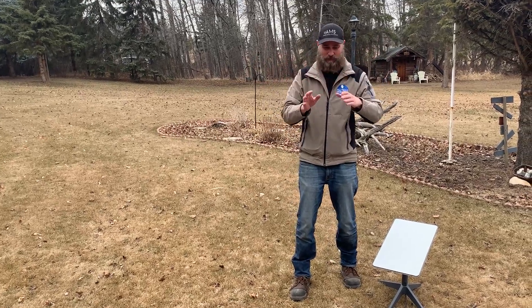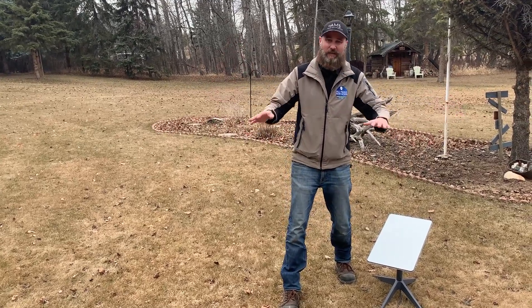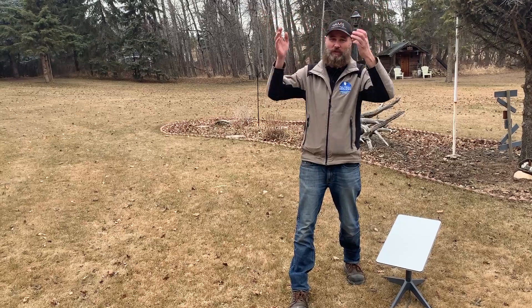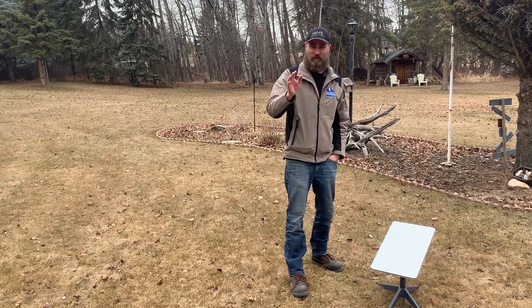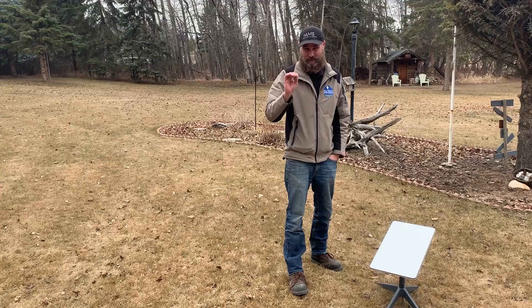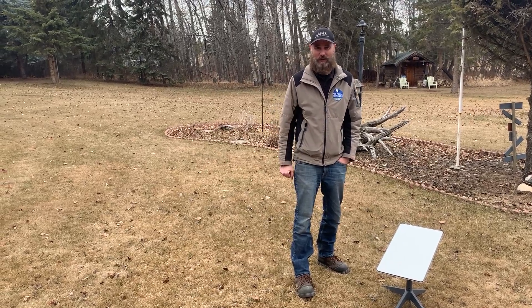Moving it back here and using the 360-degree line of view is really important, because even though the satellite is pointed in a direction that looks open, when you look around the whole sky you can see there are a few treetops still in the way. Hopefully this will clear up our intermittent signal losses for the most part — not perfect yet, not until we get it mounted where there is no obstruction.